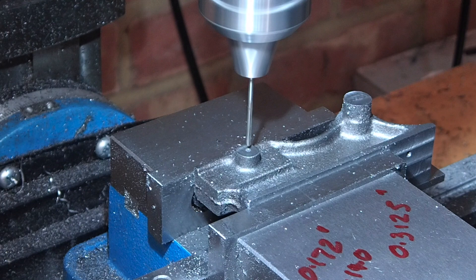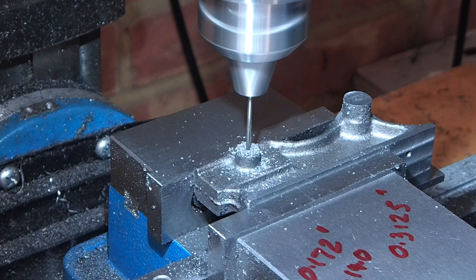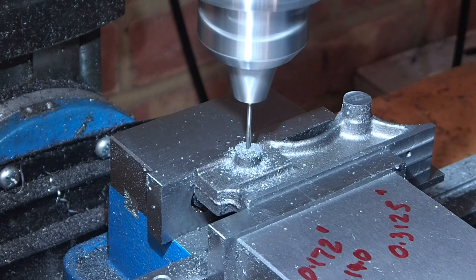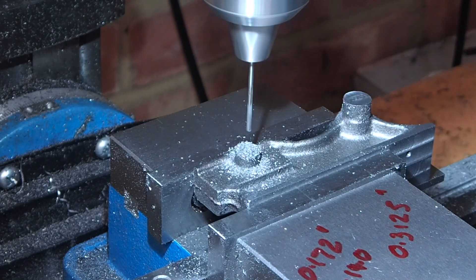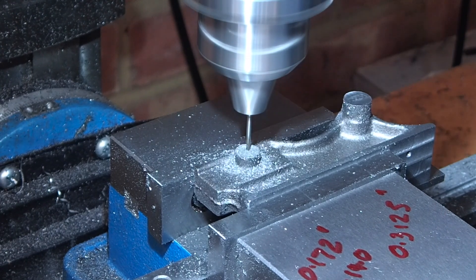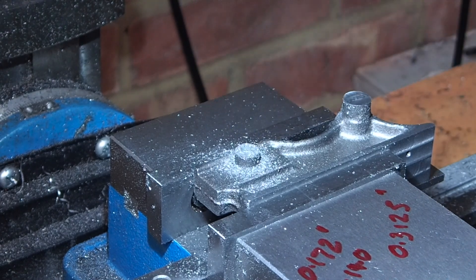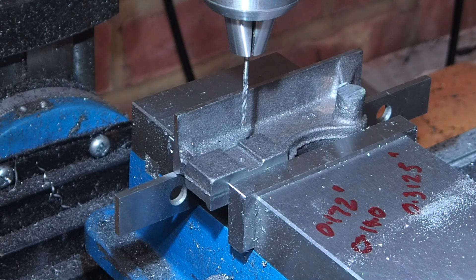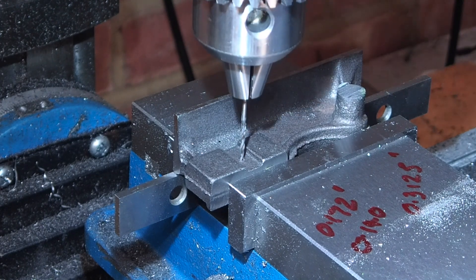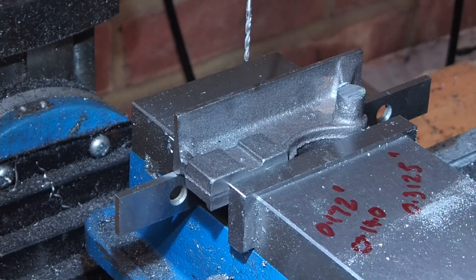Now I'm just drilling a pilot hole from this side, because all the machining needs to be done from the other side and all the dimensions are referenced from the pivot pin hole. Once the pilot hole's been drilled I can flip it over, align the drill with the pivot hole, then re-zero the DRO. The part's flipped over now, and I've aligned the drill with the hole and zeroed the DRO, so now I can start machining the features on the port face side.